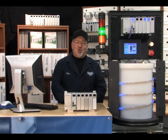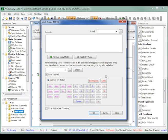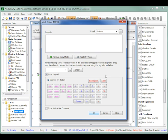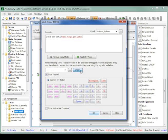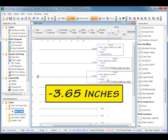With another math instruction, create a new tag name titled minimum_volume entered into the result parameter, and calculate the minimum volume by taking the tank height of 18.75 inches, subtracting the sensor face at 2 inches into the tank, minus the maximum sensor distance of 23.62 inches, and divide by the water height per gallon tag name. The result is a negative 3.65 gallons because we have the ability for the ultrasonic sensor to measure beyond the bottom of the process tank.